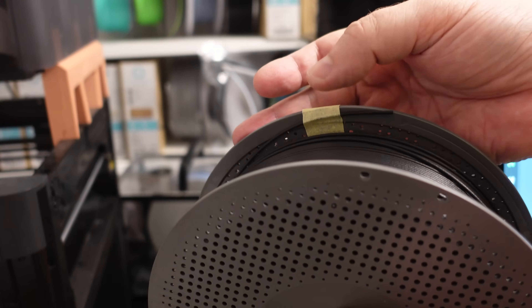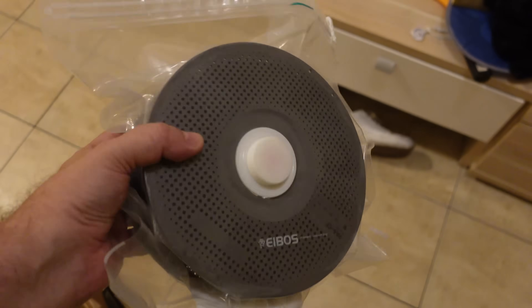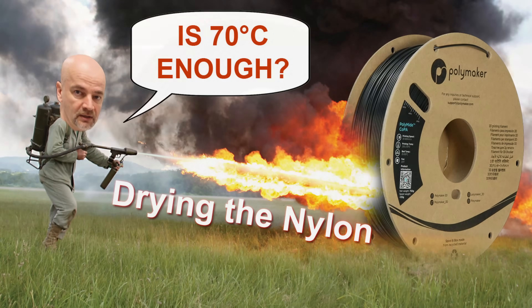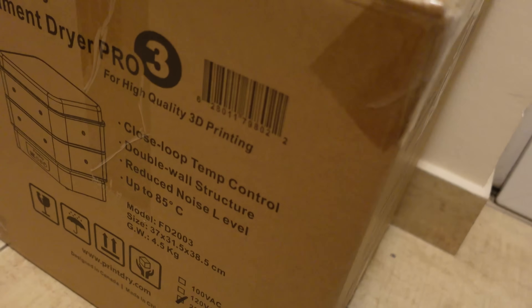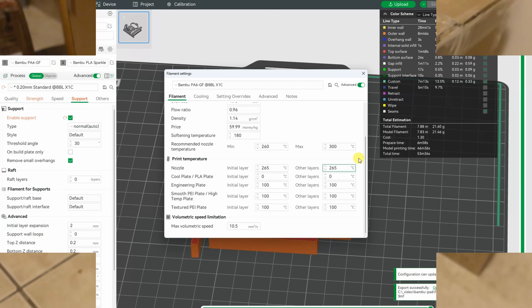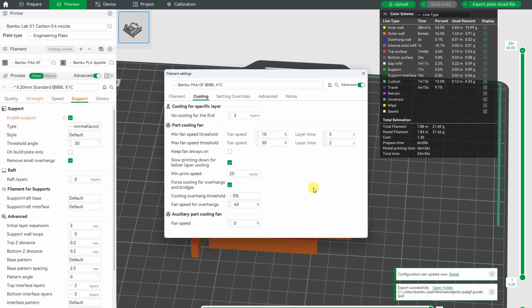The filament is glued because it is too brittle to go through those holes. It goes into a vacuum bag because I have to keep it dry — otherwise I would need two weeks to dry it at 30 degrees Celsius. I also got a filament dryer which is able to dry up to 85 degrees Celsius. Default settings in the slicer: 265°C on the nozzle, 100°C on the bed, and 10.5 will be the flow. Nice printing without issues.